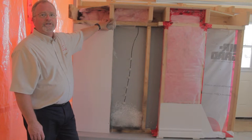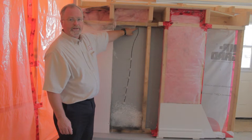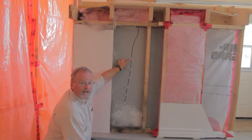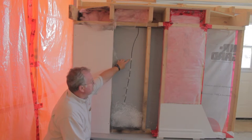In our earlier discussion with foundation cracks, we discovered these hairline cracks due to footing movement. What we see here is a remedy for a crack starting on the inside of the building — not necessary to dig on the outside. What we've done is we've inserted these injection process applicators.